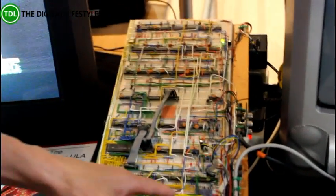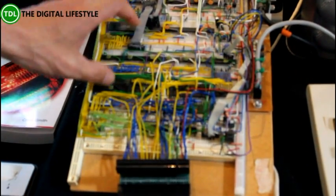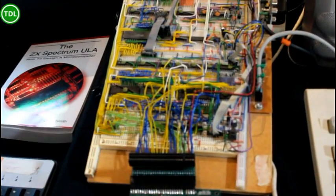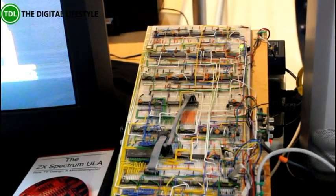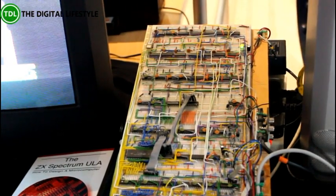Fantastic. So the rest of it here — the Z80, the 32K of memory, 16K ROM and 16K of memory — is as you'd find inside a ZX Spectrum. And this bit there is a hastily fashioned on Friday edge connector so we can sort of connect it up. We learnt an awful lot about how the ULA works, because of course it's not made anymore, and if Spectrums die because of ULA faults you have to find a surrogate for it — you can't replace that.